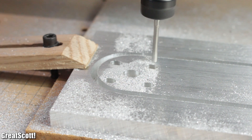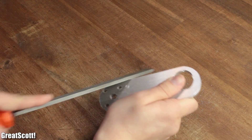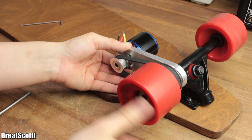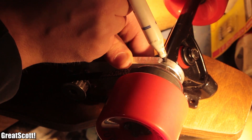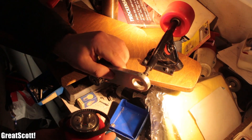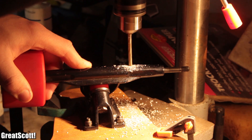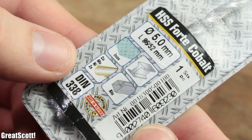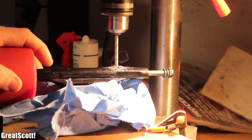Once the 10-hour torture was over, I freed the adapter from its prison, rasped down the sharp edges, and assembled the gear system, which made a good first impression. Only thing left to do to complete it was to mark the location of the yet missing M5 bolt, and drilling a hole through the trucks. Which sounds easy, but at some point we hit very hard metal. A 5mm HSS Cobalt drill was necessary to get all the way through.